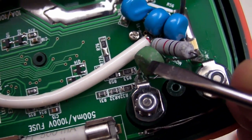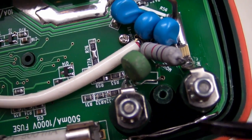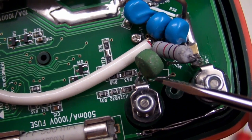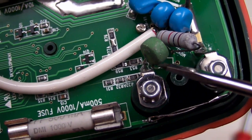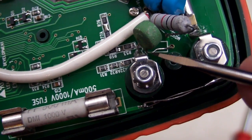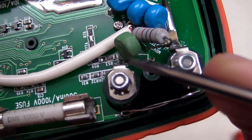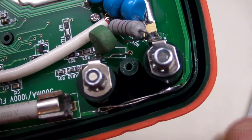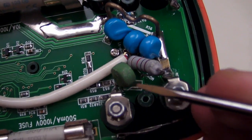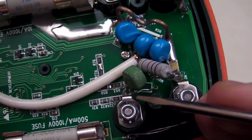And that's, well, in the case of a PTC, which is a low resistance anyway, unless a fault condition occurs and then it goes open. So during normal operation, that's not going to cause a problem. But during fault conditions, that PTC is just not going to work if this thing's shorting out to that jack. And that's what can happen when you've got piss poor construction technique with just the leads hanging around. Now, we saw that in the teardown and the review, and I said it might be a problem. And sure enough, after being beat around, this thing has moved and that leg's almost touching.